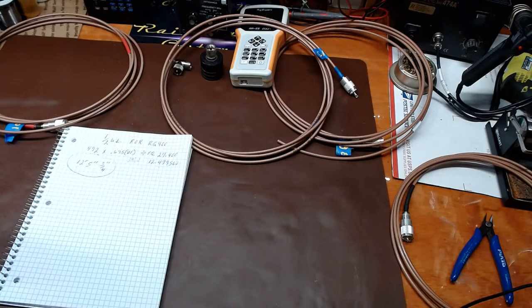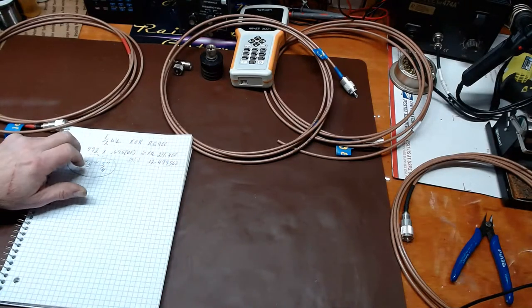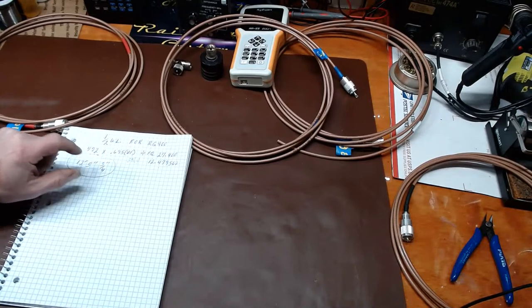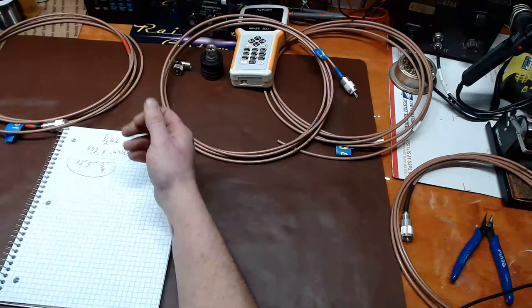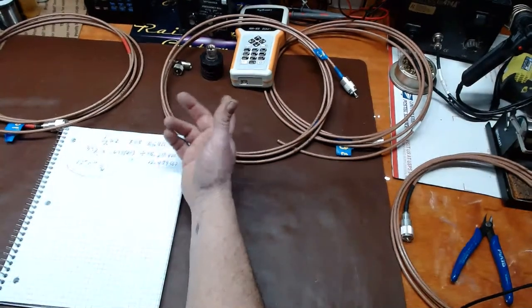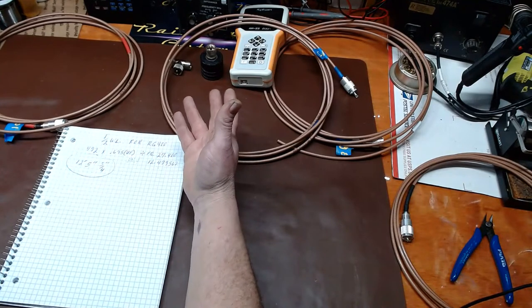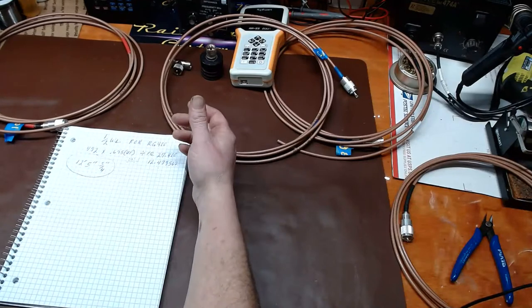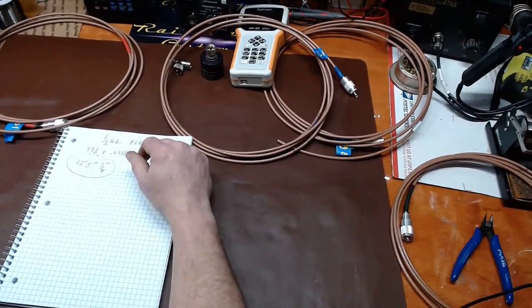It's a 5/8 wave. But it's really unique as far as whenever you're actually putting this portion of it here to use, when you actually start looking at a few different things. So one of the things that I have learned that's actually kind of important has to do with the phasing, regardless of whether you're using a quarter wave antenna, like a 108-inch whip. A lot of people have thought of 102, but whenever you add the spring, which is 6 inches, typically you have your 108 inches, which is closer to what we actually need for the frequency that we use here.